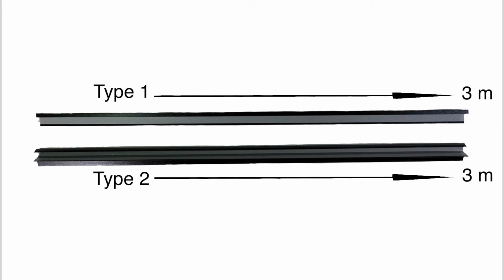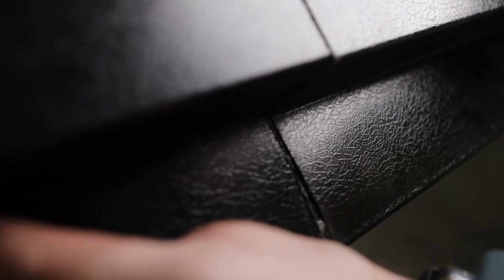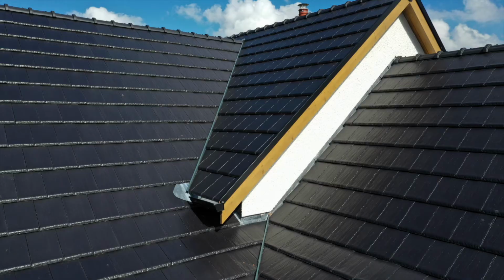down leg of the trim will cover the batten edge and allow for render to be brought up to the underside of the trim. LBS can provide a pre-made internal joint union to provide a seamless and secure joint when merging continuous verge trims together.